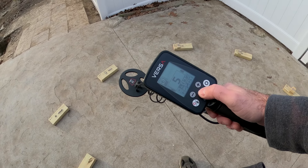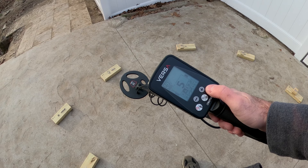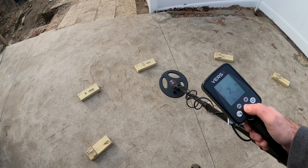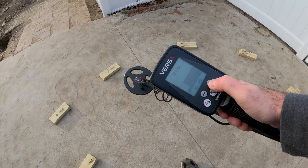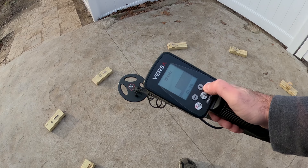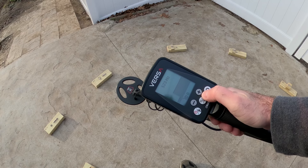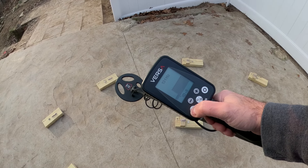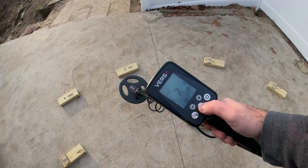We are at recovery 5 — we'll start with that. Going into the sub-menu, we're going to leave everything stock at first. The only thing I'm going to change is to two-tone, so we're basically hearing an iron tone and a non-ferrous tone — ferrous and non-ferrous. If you hold this down you can see where they go into place: negative 29, and it goes all the way over to zero where it stops bringing in the positive tone. Then all the way back to negative 29, and hold this button to get back to the main screen.